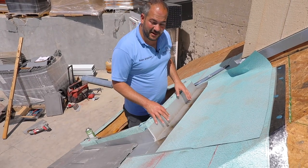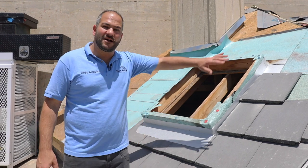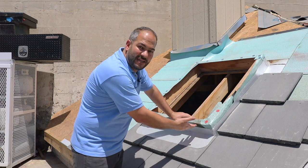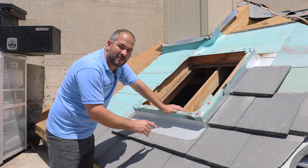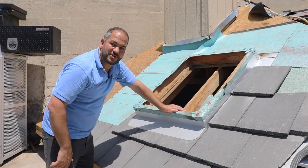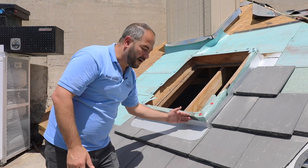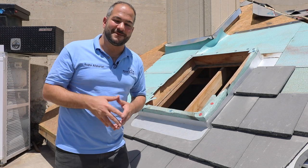Now that we've got all the flashings installed, the last step — which I'm not going to show in this demonstration — is just installing the tiles all the way around it, and the last thing would be popping the skylight on. In case you have a flashing detail where the skylight curb flashing is too small to cover these flashings, you would just be installing a counter flashing on top of this — pretty much any flat or L-shaped metal to cover the top of these flashings to get to your skylight. The height of your curb will determine the need for a counter flashing. If you do this, you're going to have a watertight and waterproof skylight for years to come. Thanks so much for watching — like, subscribe, and we have a bunch of other videos for tile and flat roof installation tutorials. If we're missing something, let us know and we'd like to fill it out for you.